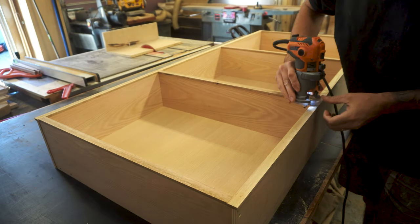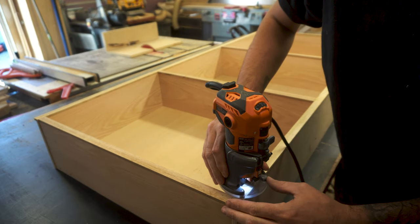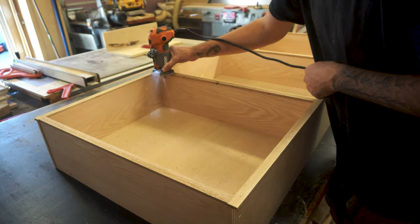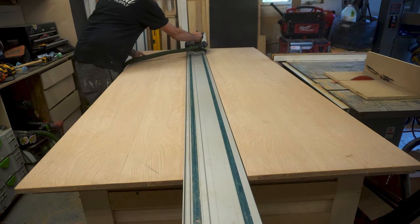And then cleaned up any proud bits of edge banding using a trim router. I'll link the router bit that I'm using here in the description down below. Once the cabinets were cleaned up, I made a start on the doors.